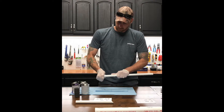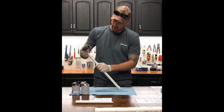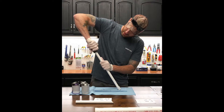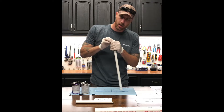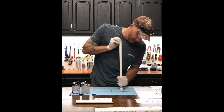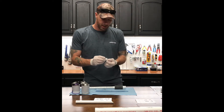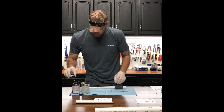Next, take your gasket that you shaved down and run it over your half-inch PVC rod — just like that. If it splits where it was separated and glued, don't worry because we're going to take some string and secure it. Once you have that on, take your half-inch PVC coupler that we cut one end off and filed down with a round file, and glue that onto your piston rod. Make sure you use this in a well-ventilated area — it is stinky. That coupler sits right inside and should just touch the gasket tightly.